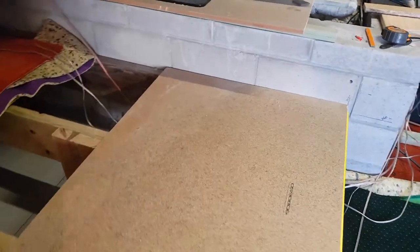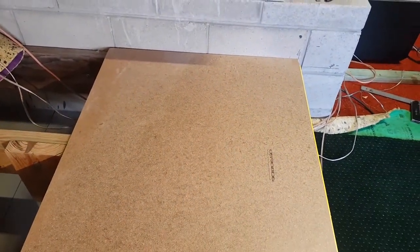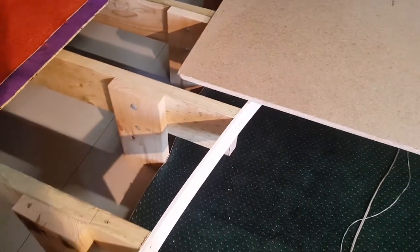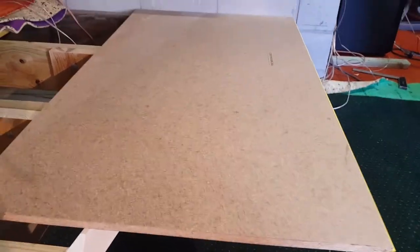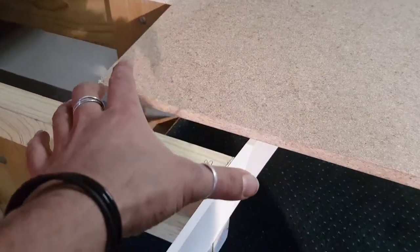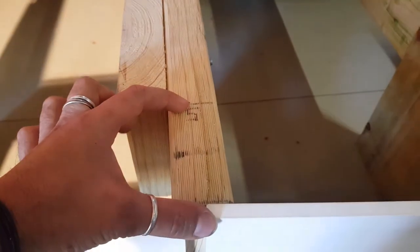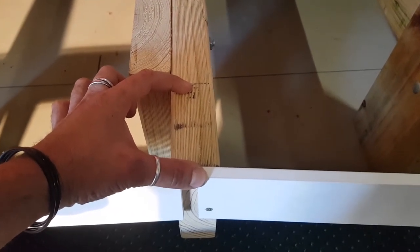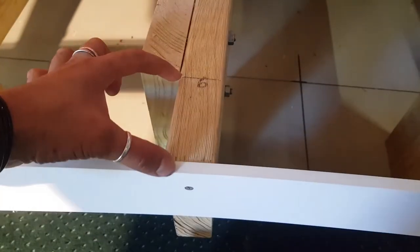What I planned on doing is just throwing the cardboard template on and basically doing the line, etc. But if you have a look here, you can see you're actually cutting off to throw away a good chunk of this bit of flooring. And look here, it just gets narrower and narrower because it's on the curve. It gets narrower and narrower until, and I've already done this, you get to this center part and this much is over the joist. That is all of the joist that is actually going to be supporting the center parts. You can see I've got that line drawn there.